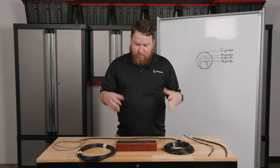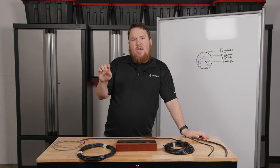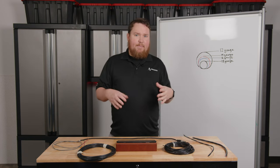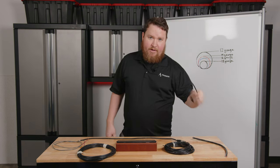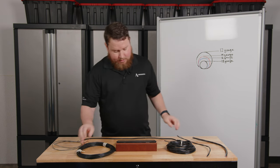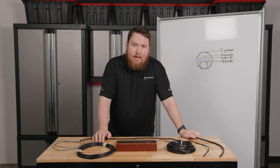So what do we need for a 70 volt system? Basically, first we want to make sure that we don't run too thin of a wire over really long distances. Otherwise, we're not going to get all the wattage from the amplifier to the speaker, and it's not going to get loud enough or it's going to have signal degradation. Does that mean we always need super big wire — always go with 12 gauge? I've got 12 gauge right here versus 16 gauge, which is drastically smaller, and 18 gauge, which is way thinner. The answer is no. It's all about the distance you're running and how much wattage you're pushing through it.